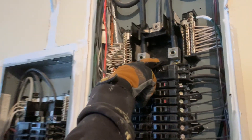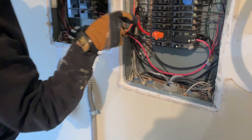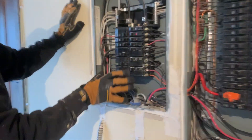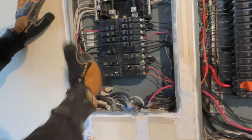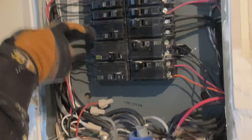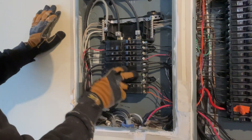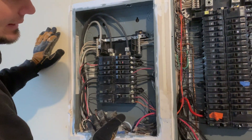This is a 100 amp panel with aluminum right off of here, but this is four-aught aluminum, 200 amp. So I wanted my kiln to come through and down to here — 50 amp — and I want my Tesla box here on this panel. This 100 amp is already running some small ACs and one medium AC, and then it'll be doing my level two charger. They'll be charging at night, so we won't be competing with air conditioning during the day. The rest of these items might be a dryer — they're going to do that at night — but all these other branch circuit breakers, so not a big deal.